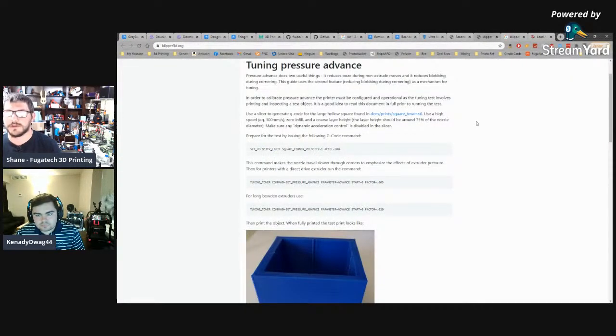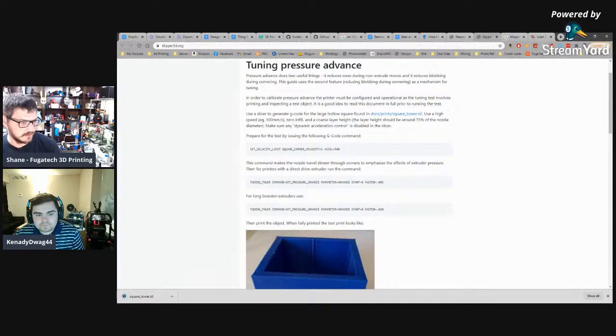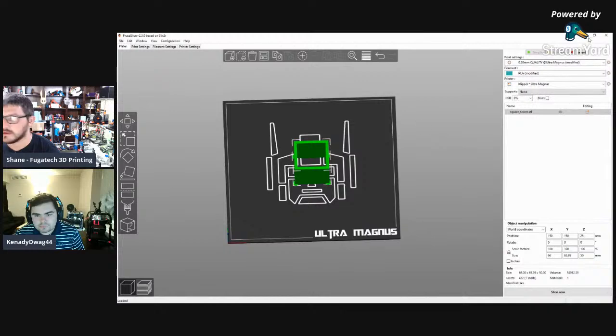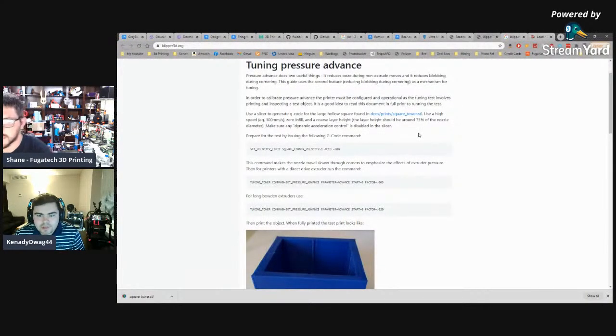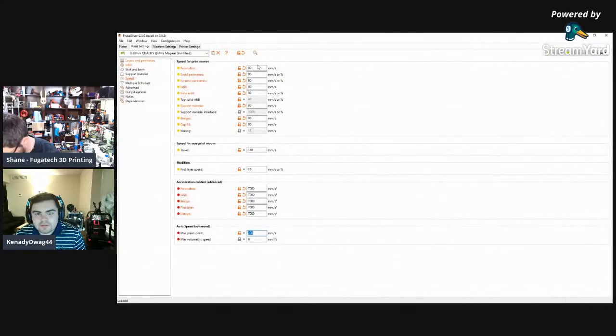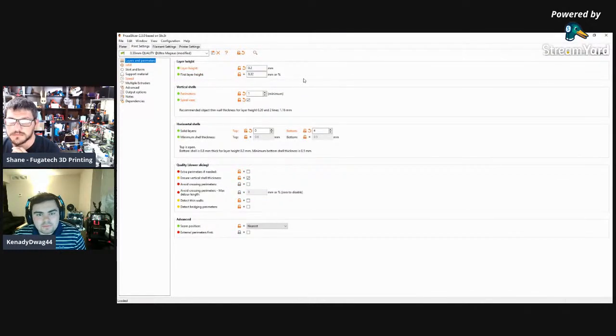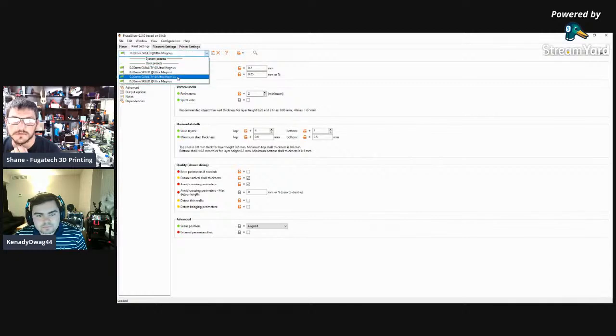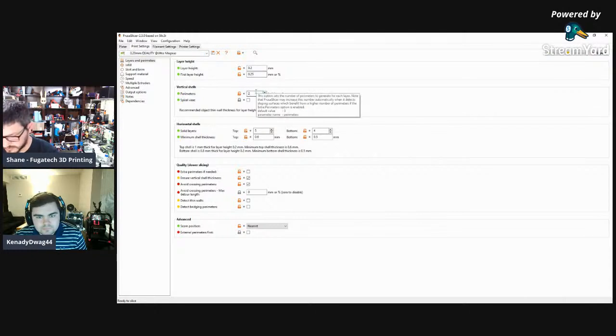Okay, so pressure advance. You need to download that Square Tower STL. We will delete that, pull that in. All right, there's that. Okay, and then we just need to set up the slicer. So you can keep the speeds. Okay. We're still doing vase mode? No vase mode. Okay. But 1 perimeter. Let's go back here to 0.2 and then 1 perimeter.